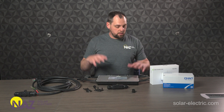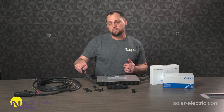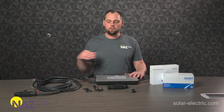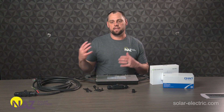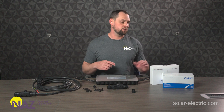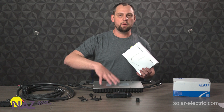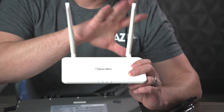The trunk cables and the inverters all just connect together. You've got your MC4 connectors on the ends. What's really cool about these microinverters specifically is they don't use that power line communications — that corrupted communications that gets interference. These use a sub-G wireless communication to the DTU. There's about a 900-megahertz communication coming from these microinverters to the DTU. The DTU can pick these things up from pretty far away — it's really impressive.